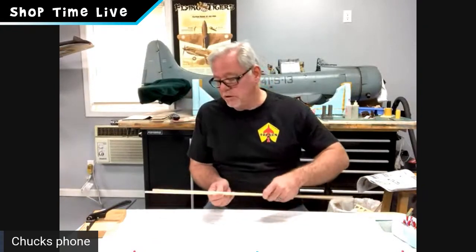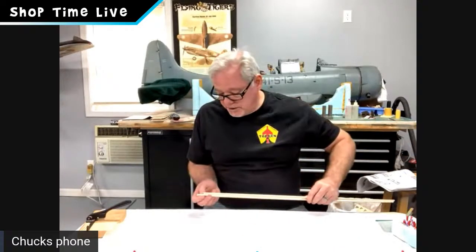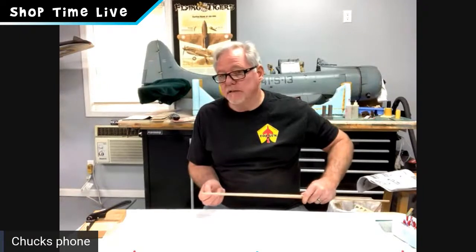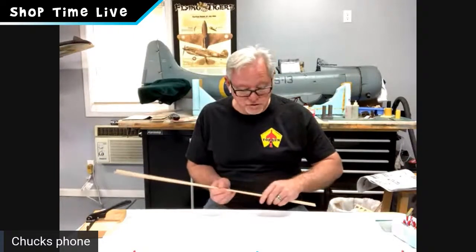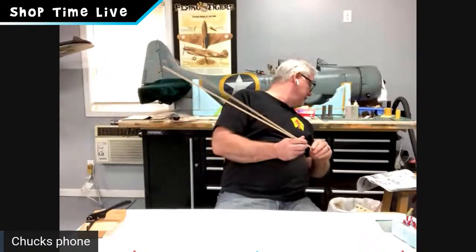Okay. And so I have two colors here. I don't know if you guys can really see those. I have a lighter one on the bottom and a darker one on the top. I just use a pinch test with your fingernail and dig in there. Whichever one is harder, that's the one I'll use for that top long run. The softer one I'm going to use on the bottom long run, and you'll see when we get to step four, on how we have to bend that to make a curve, that's where I'm going to use the softer one. So just a little tip there.